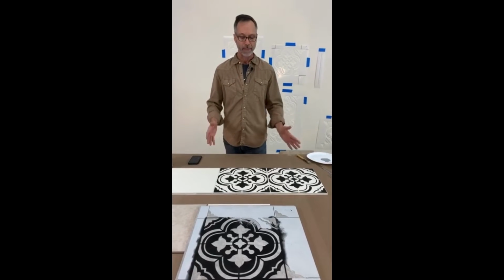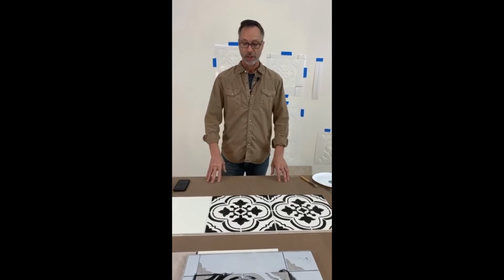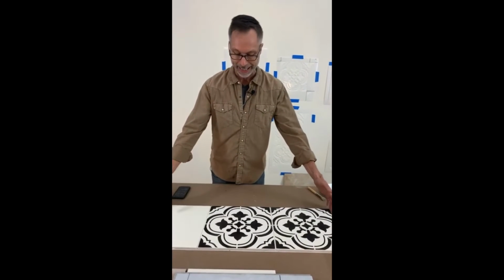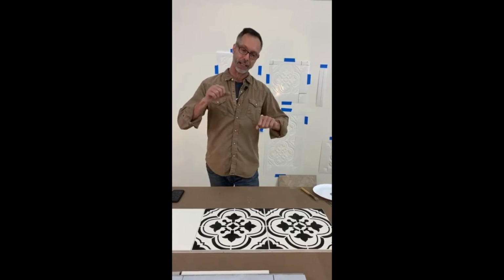We've been talking about tile floor projects. We've gone over it from soup to nuts. We started maybe 3 weeks ago talking about how to do it on existing tiles like this, but we've brought it down onto the floor here to our old cement floor in our studio. I've done some repairs and I base coated it in some flat Navajo paint. We like to stencil flat on flat. You get great adhesion, fast dry, and all of your durability comes from your top coats. So we'll put a nice water-based top coat on top, and that will protect your artwork.